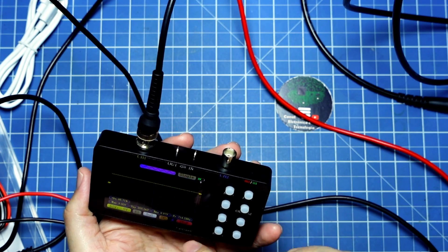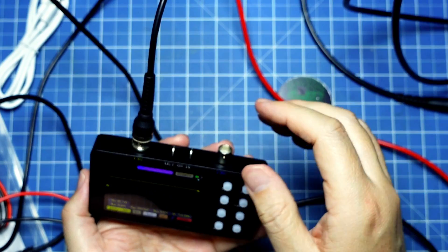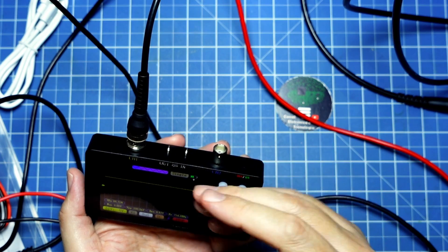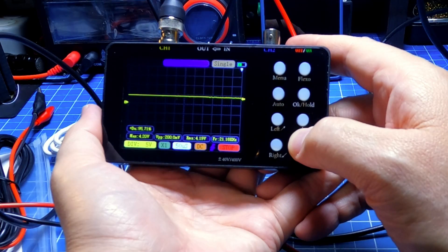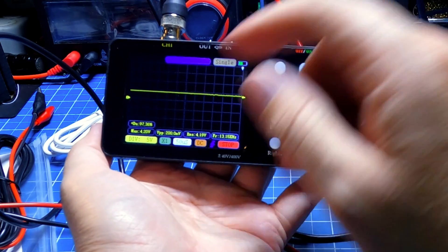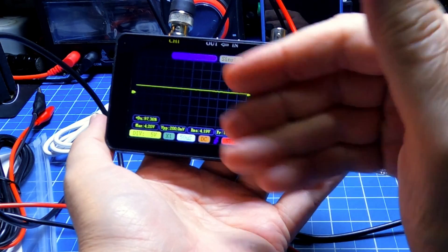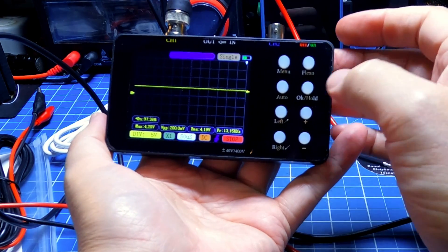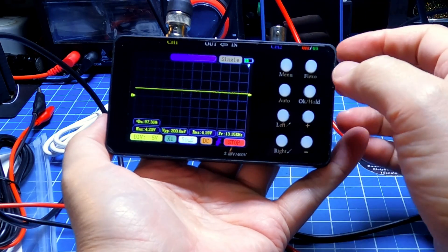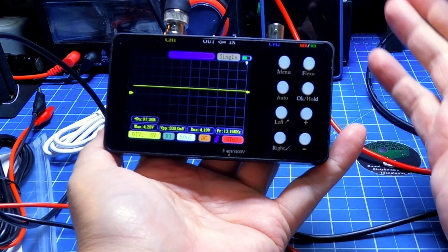I can see the signal captured. However, I am unable to capture the power-on ramp as clearly as I would like. It seems there are some configuration conditions I'm not meeting. Ultimately, I didn't manage to capture the source turn-on transient well — it was a problem of speed or configuration — but it really didn't work as hoped. It's a shame, because it's an interesting tool, but few portable oscilloscopes can do this type of single-shot measurement.